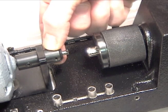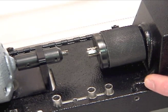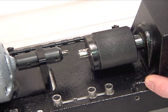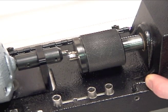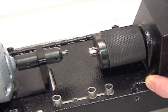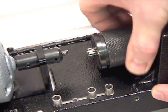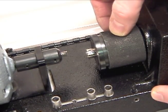Next, turn the cutter so one flute is positioned straight up and down. Push the original key on the shaft until it stops on the depth stop pin. The key blank should have recessed slightly further into the collet. Further tighten the collet to hold the blank in this position.